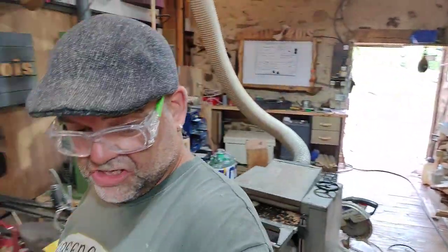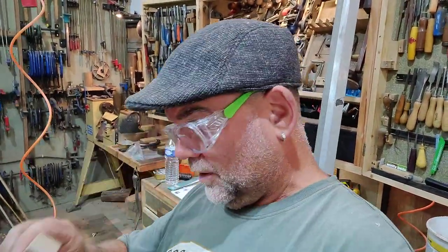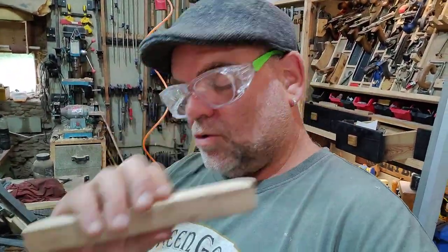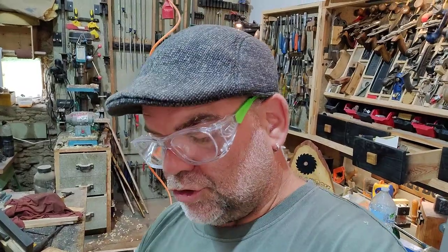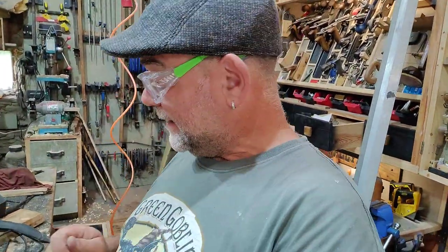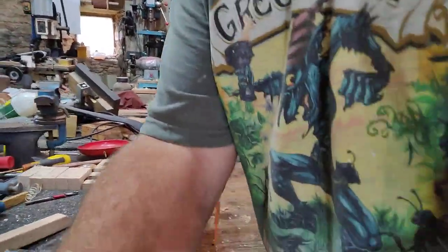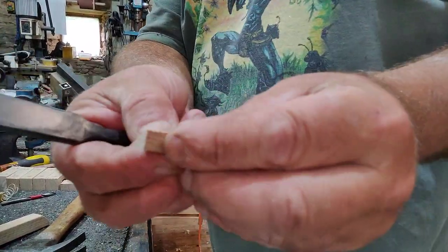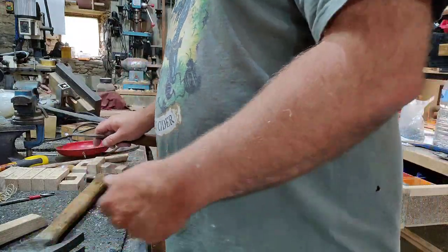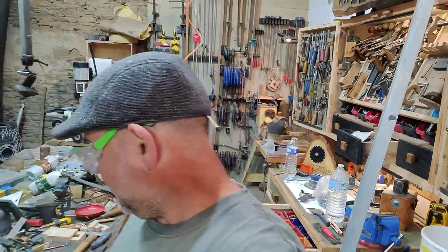Yeah, little bugs. The other way you can do it, if you don't like the staining, if it's a little bit of wood, because I think it's come and gone, to be honest. If they're not fresh holes and you've got this blackness around the holes, what you can do is literally drill them out and drive a bigger piece of wood in. So drill a hole, make the hole a little bit bigger, and then grabbing your chisel and a piece of wood, it could be a little scrap like that, you slice it down until you've got a bit of tapered piece that you can drive into the hole. A bit of whittling will do the job. But that's up to you. That depends on what you want, doesn't it, really? What you want from it. But that's pretty good enough for what I want.